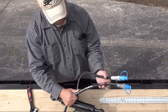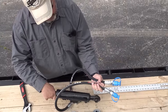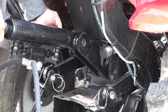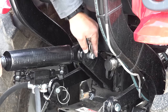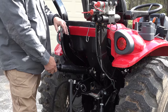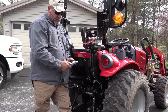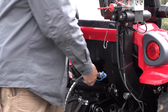I think I want to set it upside down and run the hoses across the top, because my quick connects are on the top above the top link pin. I may use some springs to keep the hoses kind of pulled together. I'm going to take my pin and put it through — I can see up here on the back there's a little bit of a bow on the bracket that goes across here. I found from using the bigger top link that this stuff doesn't need to be on top — live and learn. Remember to tighten these up — there's a brass crush washer here; tighten it up tight enough that it doesn't leak.